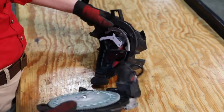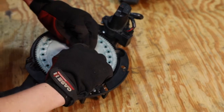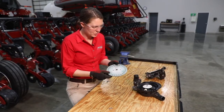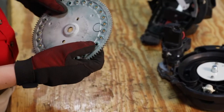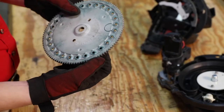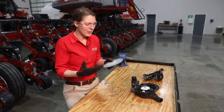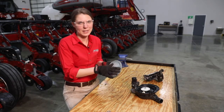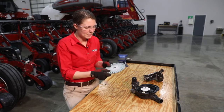On the vacuum side of our meter cover, the first thing we are going to look at is our seed disc and the wear on that. Key maintenance items on the seed disc: first, we want to check that the cells have maintained their shape and haven't egged out. We also want to look at whether the cells are still raised and still have a flat top, because these raised flat cells do provide agitation. If we feel that we're lacking agitation in our seed meter, check whether these cells are still raised. Those are the things to check on the seed disc cells prior to each season.